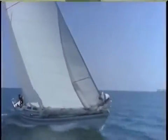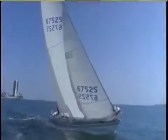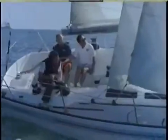In this case, we have a leeward hoist. Either side is possible, and the choice will depend on which groove and tack fitting is free. When the luff tension is set to the halyard mark for the new sail, it is sheeted in. The old sheet and halyard are cast off, and the old sail is pulled down.